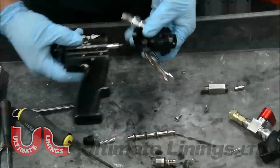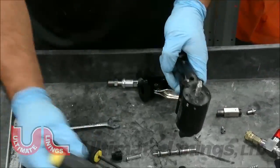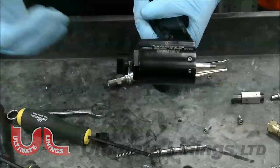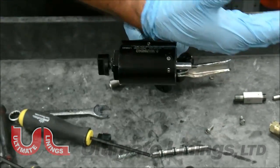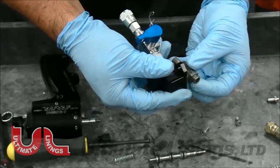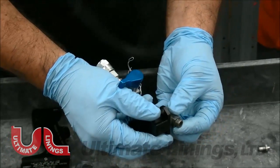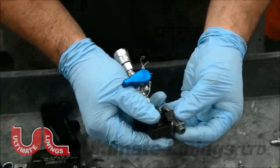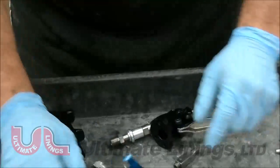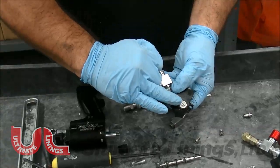If you hear exhaust when you turn it on, that means the first two O-rings are worn out. This is your main body — you've got an O-ring here and O-ring here. When you turn it on, air goes right in here and activates the trigger — trigger on engages it backwards, when you let go it pushes forward. The spring pushes the side seal right onto the mixing chamber, which is how it holds pressure — up to 5,000 pounds. If you have a scratch on the mixing chamber or side seal, material will blow right out when you open the valves.